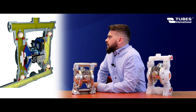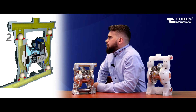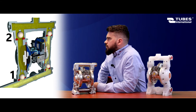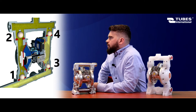The air valve directs compressed air into one of the chambers. There, the air pushes the membranes outwards and forces the valve — valve number 2 — to move up, pushing fluid out, while at the same time shutting the bottom valve number 1. The other chamber makes the opposite movement, producing vacuum. This enables valve 4 to shut and valve number 3 to open, allowing fluid to be suctioned in.